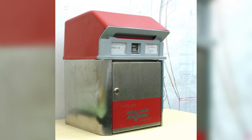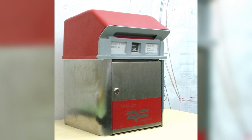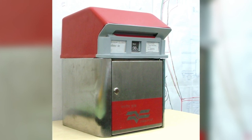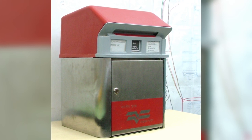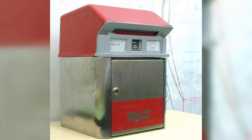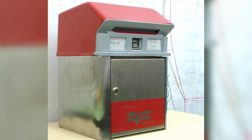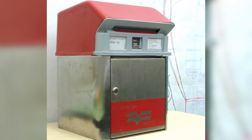Here comes our first prototype made all out of hand. Look at those shining parts which are undulated — they look handmade, right? Because in handmade there are a lot of stresses in the plastic. The top is also hand done in our vacuum forming machine. The front panel is fabricated using small parts of plastic joined together, which is a very, very important technique students in design learn to make a quick prototype or mock-up model. This is a mix of a prototype and mock-up because the bottom section uses stainless steel which is strong, whereas the top, which is supposed to be injection molded, is not one piece — it is like a mock-up because it has small parts which can break very easily.